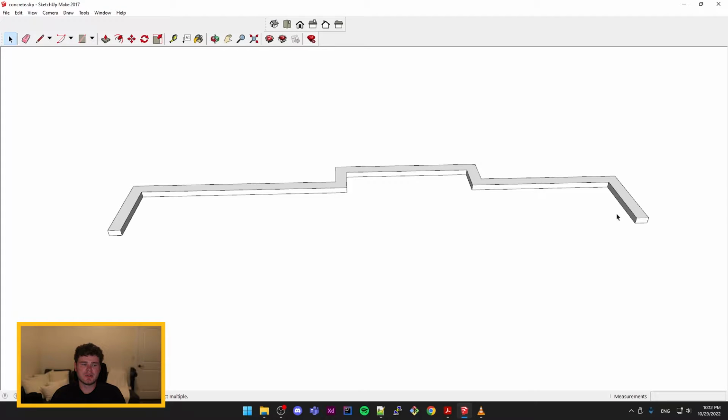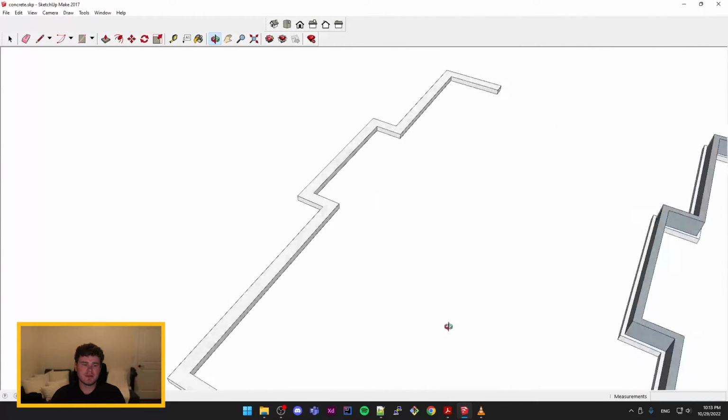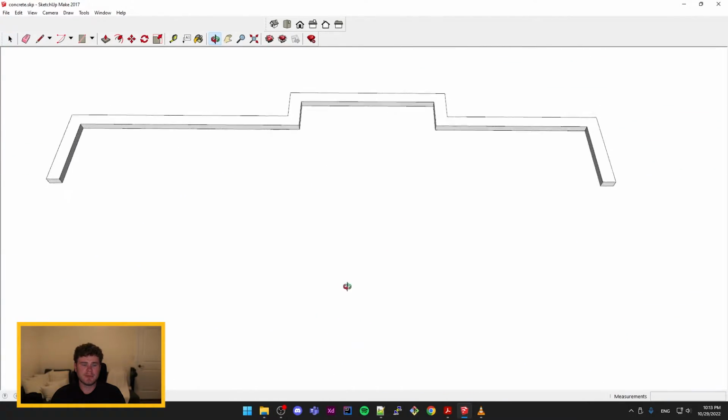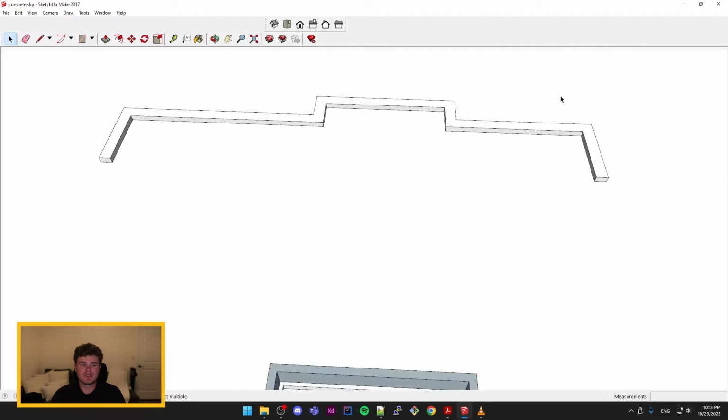It was very easy to pour. My dad and I did it ourselves. And then the foundation wall stands on top of this footing. So the footing looks like this, which you probably remember from the short I posted, is just this shape here. The foundation stem wall will stand on top of this right here, and we'll have just a 2x6 8-foot wall along here, and then ICF the rest of the 3 sides, which I'll show you.